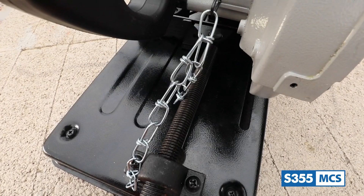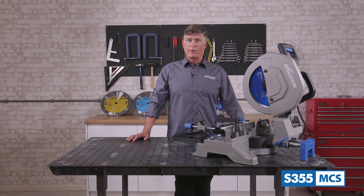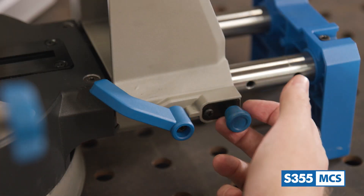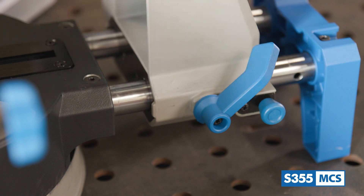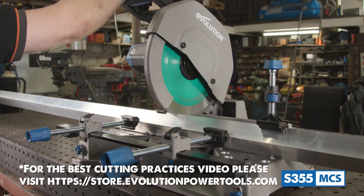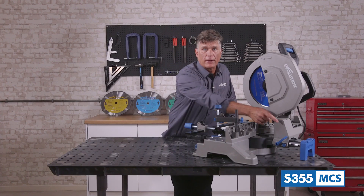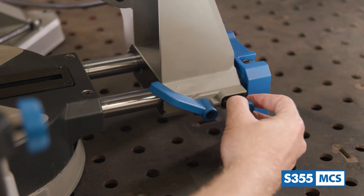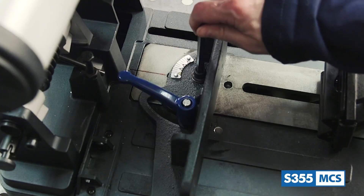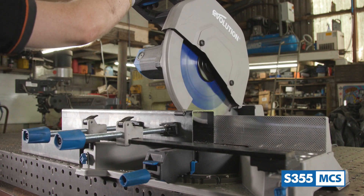This is a much smoother operation than the old chain locking mechanism on many chop saws. You will have noticed the sliding rail the head is attached to — I must stress this is not to be used in the same method as a sliding miter saw. The glide rails are for quick release repositioning of the saw head in order to reposition the angle the head will hit the metal stock, which is essential to reduce the stress on your blade. If you require assistance on how to optimize your saw for maximum blade life using this feature, please visit the Evolution Power Tools support video on best cutting practices for the S355 MCS on the Evolution website. A locking pin can be located here, and once released, the head can be smoothly adjusted along the glide rails into each of the three set positions — saving a lot of time compared to chop saws that require vise adjustments using an Allen wrench. This innovative glide rail and locking pin feature have been patented.